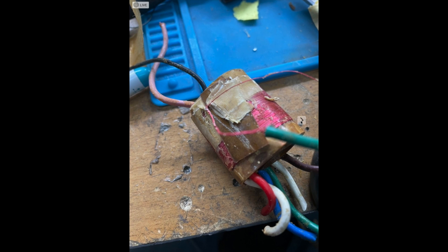When you've done that, you're in a position to start taking the whole thing apart. This is the primary winding - I've already taken off some of the turns. You can see the way it's constructed: it's got wax paper between the main windings, and in between that it's a quite flimsy, almost tissue-paper insulation. You can see why the primaries on these LOPTYs failed. You can also see here a tapping, which is simply a loop of wire twisted on itself and brought out, then insulated with what I think is glass fiber tape.